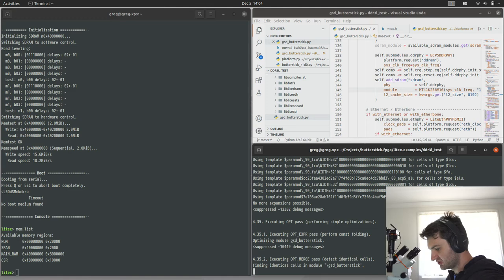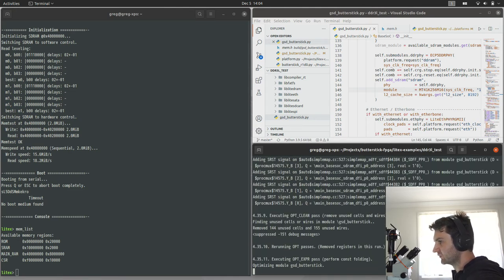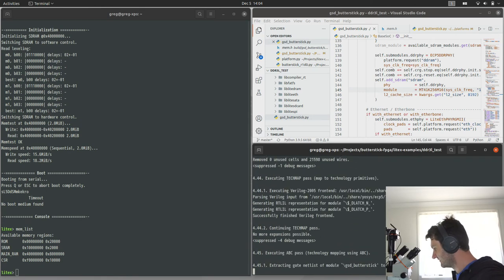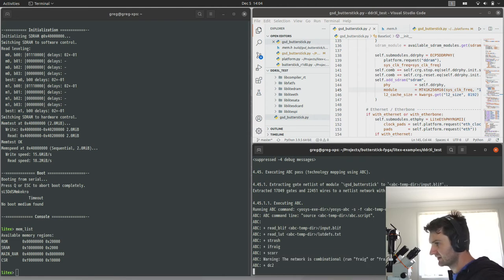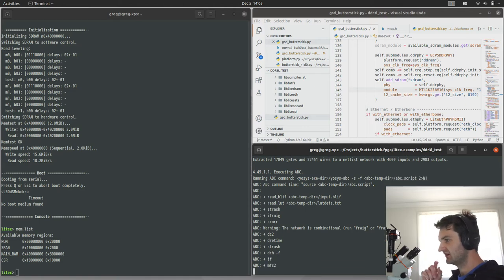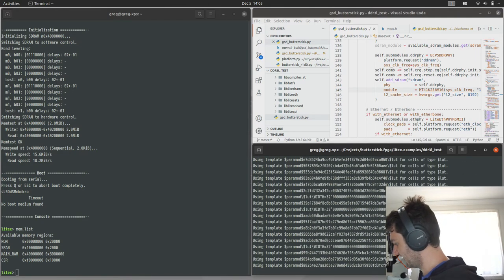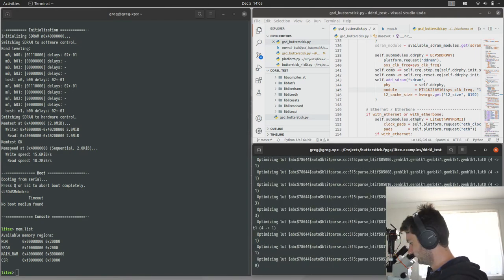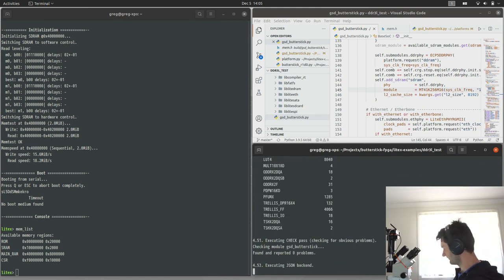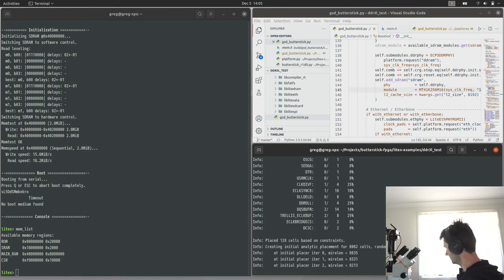And so what I want to show here is that the DRAM, we can test all of the memory. And then I'll grab another unmodified Butterstick and run the same test, and we should see it fail. Once it gets to about one quarter through memory, the 256 megabyte boundary, it should fall over.